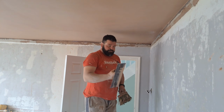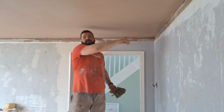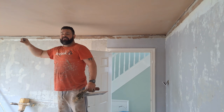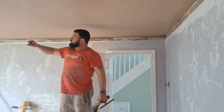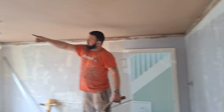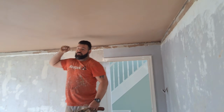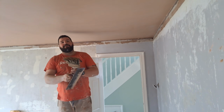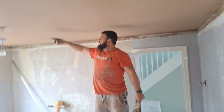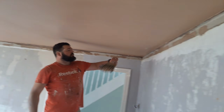What you've got to do is, when you come the opposite way, go like a typewriter. So I'll pull this wall back as far as I can, and then I'll go halfway down the ceiling. Well, I'll show you in a minute, but I'll pull it that way in, and that way I'm leaving a line right across there, so when I go forward again and I pull back, I'm covering over that line. It's always about making sure, like I wouldn't just leave that line there. I'll then have to go forward again and come over that to make sure it's gone.